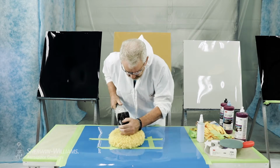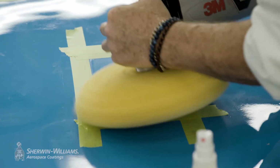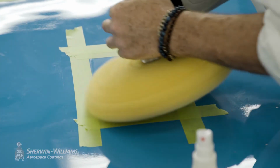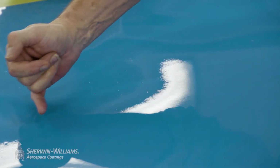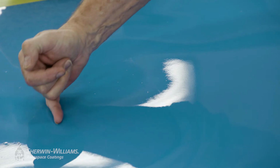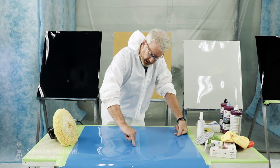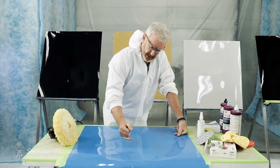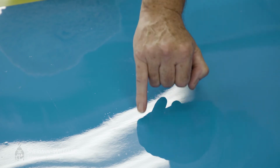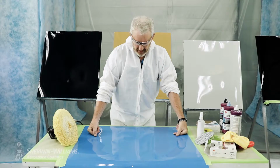Start off on a low speed and just build into it. You can see the gloss recovering immediately. So as you can see, we've got the profile of the original paintwork. We're coming into the repair itself. Following the light source, the profile is the same. It's not sanded flat, where it's obvious it's a repair. The edges are nice and glossy, near invisible in an MRO environment. So we would call that